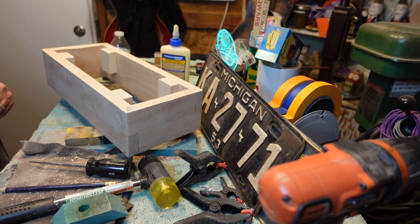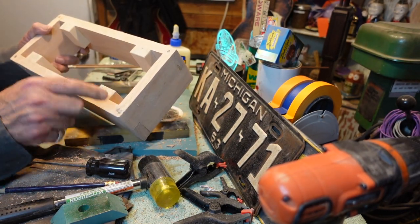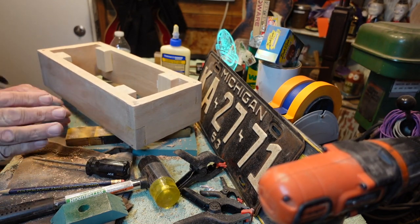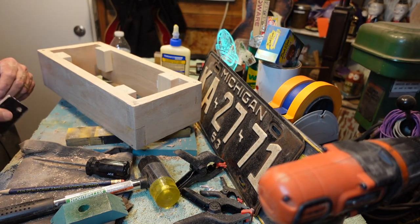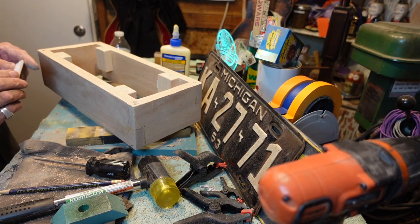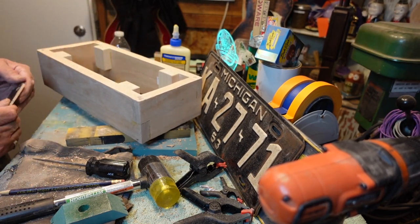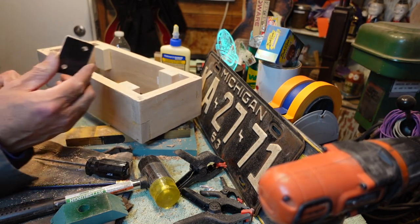All right, the next thing we want to do is dowel through these pillar blocks that are going to hold the plate. Now, whenever I am going to dowel something that is in two spots, or running strings, or cutting string holes for string keepers and a tail piece in the thin wood, I never want to put things in a line. So I've cut a template that's the same size as one of these pillar blocks. And I'm going to decide that I want the dowels to run at an angle. So I've cut them at an angle.